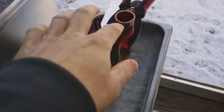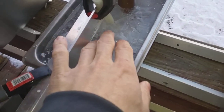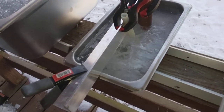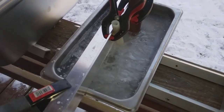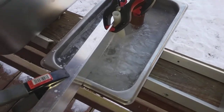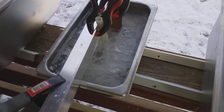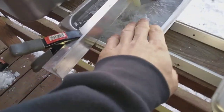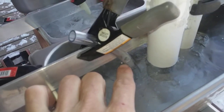As a little experiment, I dropped this copper pipe in just to see what would happen, but mostly I'm working with plastic. Here's some rubber tubing inserted to try to relieve internal pressure. I could use a directional freezing technique — like what people do to make clear ice — to displace air in one direction so liquid water and air don't get trapped. The solid ice expanding and compressing eventually fractures because it can't compress liquid water. I was trying to relieve that with a tube. This one didn't work — it heaved anyway. But this one, with a little piece of vinyl tube, did push an ice plug up through.